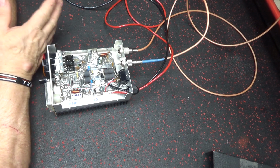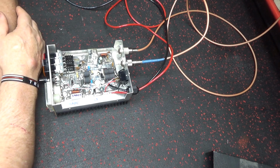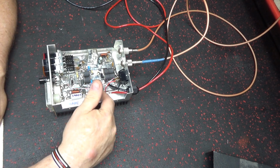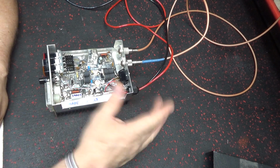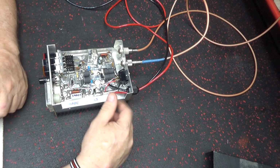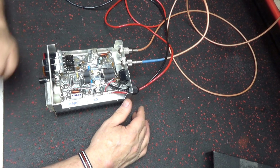Oscillating, change key up circuit to start with. But like I said, I don't know exactly if that's what it was, but I done it and it quit. And I did do one thing at a time on that one. I added another diode there. It's got two in there. That is a diode. I added another one there, so if you happen to hook it up backwards, it'll blow that diode. So if you hook this up backwards, do not hook it back up the right way. It'll blow these diodes. I can pull these diodes out, put new diodes in it, and you go on and run it, and hopefully it won't take out the rest of the amplifier. So keep that in mind.